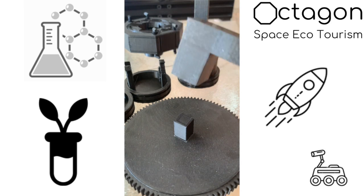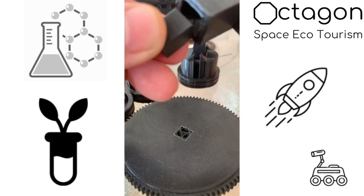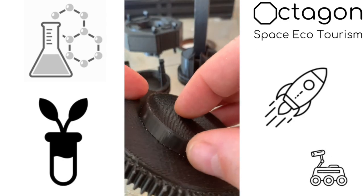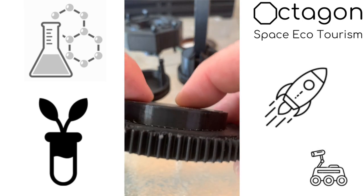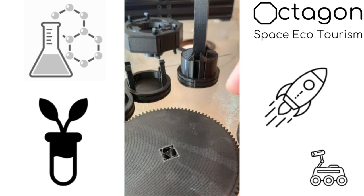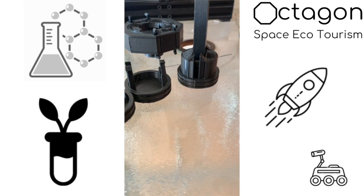The funny part about it is, the first time I printed it, I got this thing wrong. Tried to jam this guy in here, and that's how I broke this guy. And just to talk about design mistakes, when you're putting two things together in Tinkercad, you get a 0.2 or even a 0.01 millimeter difference, and the slicer thinks it's two independent pieces, and these two things came apart. 40% infill, most likely, maybe it's 20. But obviously that was a failed print. That was a bit of a disappointment.